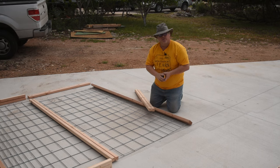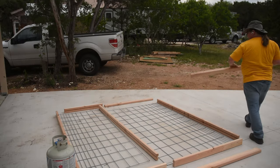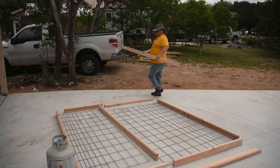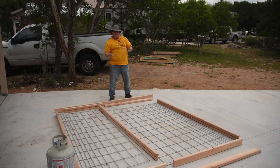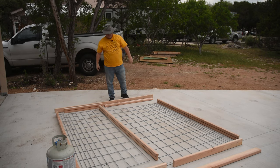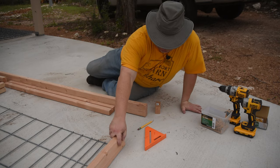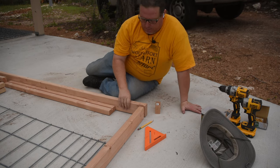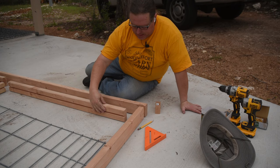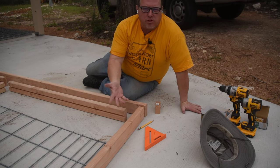included incompetence factor. So with all the parts cut, I'm gonna use two 2x4s as a substitute for those upright posts. These will lock the gates together, but I'll assemble it the same way I would as if these were the posts, starting with the bottom rail. Now, in this design, the bottom base plate actually is not going to be the one that's holding the majority of the weight. Most of that is going to be on these side pieces anchoring into the post. The bottom one is actually almost just trim.